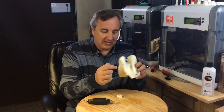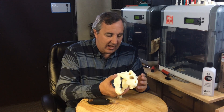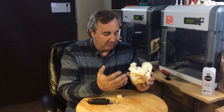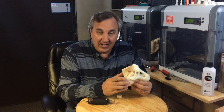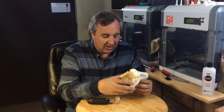There were also a few leaks coming out the sides, so if you print this, you probably want to print it at higher than 20% fill like I did — especially that section, though with XYZware you have to set the whole thing. Overall I was kind of pleased with it — it was cool to watch. If I did it again, I'd print it at a different angle so I wouldn't have to cut a piece off. I'm sure you can get better results by learning from my mistakes.